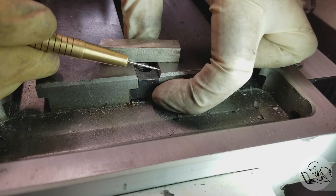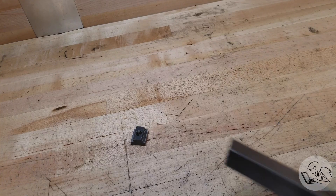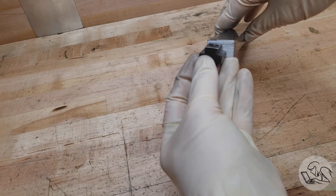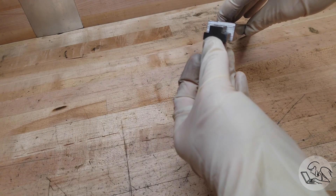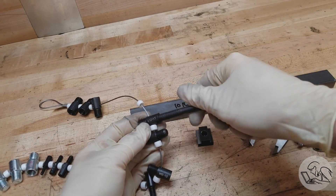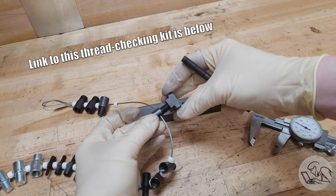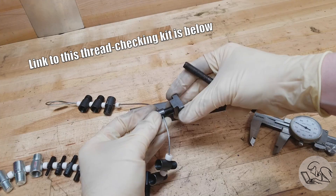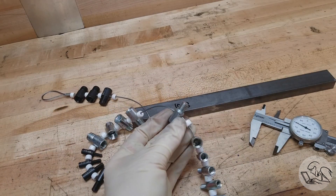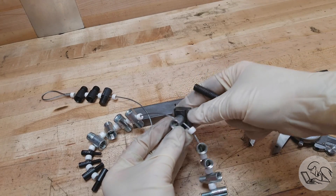The top surface needs to remain below the top surface of the table so that you get a clamping action on the top surfaces of the slot, rather than just the T-nut tightening against something but remaining loose in the slot. You can save yourself a lot of work by grabbing a piece of steel about the same dimensions as the T-nut will be. If you're trying to match existing T-bolt hardware, make sure to measure the threaded rods and the nuts — the threaded rods in my case fit M10 1.5, but the nuts reveal this hardware is actually 3/8-16.